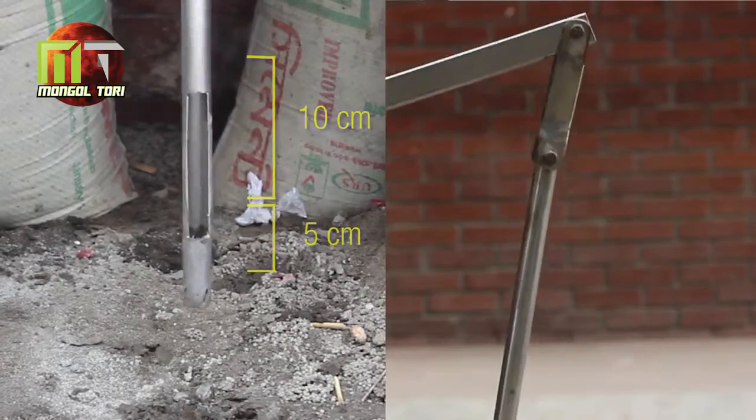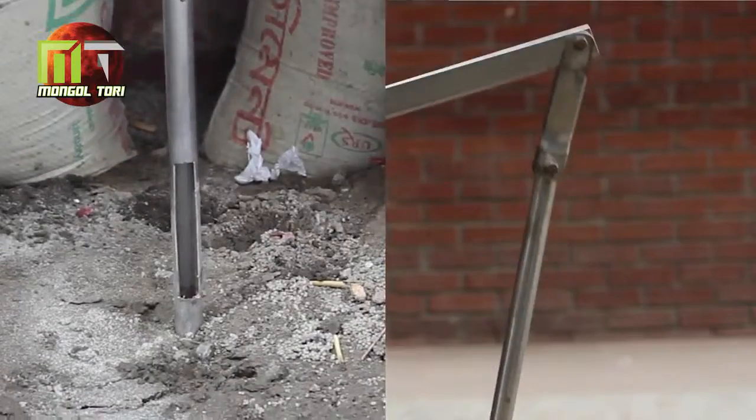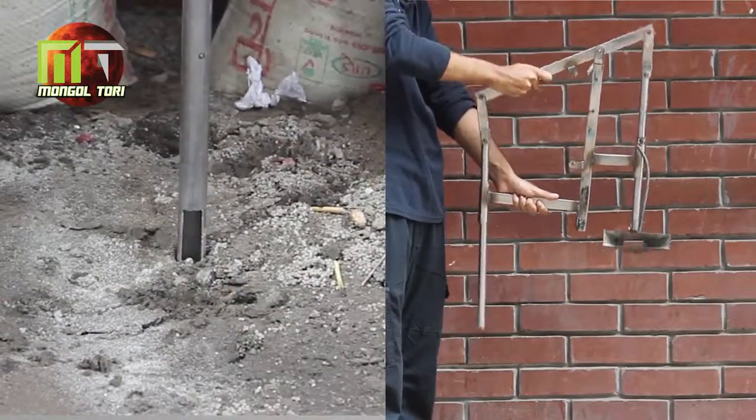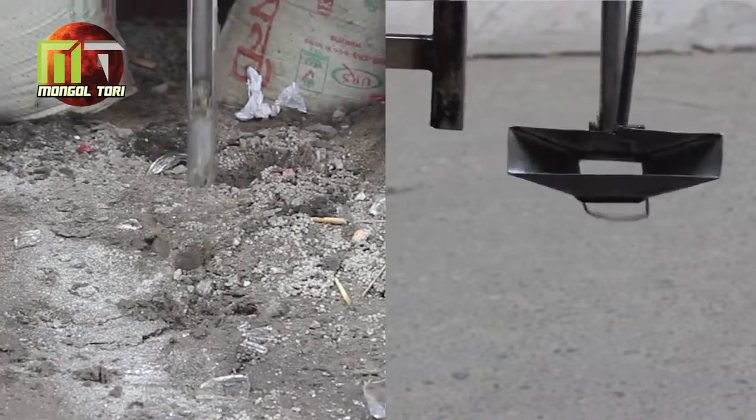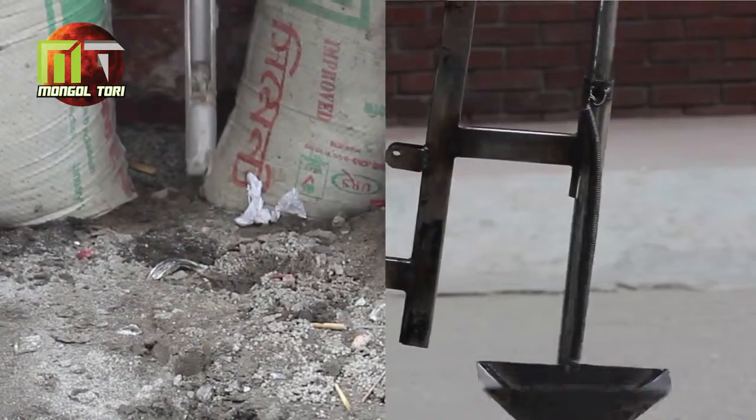To complete the science gas task, we have built our own module which consists of 1 actuator and 1 hollow pipe. The first 5 cm of the pipe is as usual and the next 10 cm is slightly cut so that the excess sample can drop out. While the pipe is entered 15 cm into the ground, it can hold the sample from the bottom 5 cm and drop the top 10 cm.